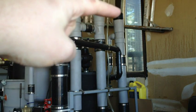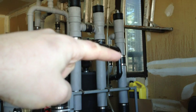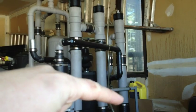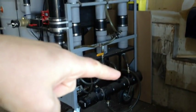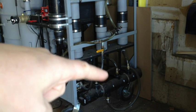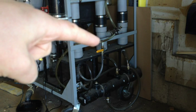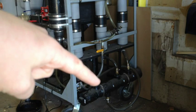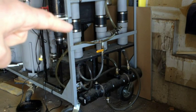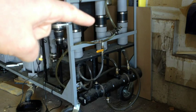Now that's all changed. I basically have water coming up through here, and right where that rubber coupling is, I have a sink drain. Then coming further down, I have another sink drain. And if you look further down, the water drains down into a reservoir right here. Then the gas moves to the left. Just in case the vacuum is too strong and the water gets sucked in, there's another drain for that too that goes into this reservoir, which is a three inch ABS pipe. So this last one here has nothing much in it — all I have is stainless steel scrubbies in it. And this is the only one with the water.